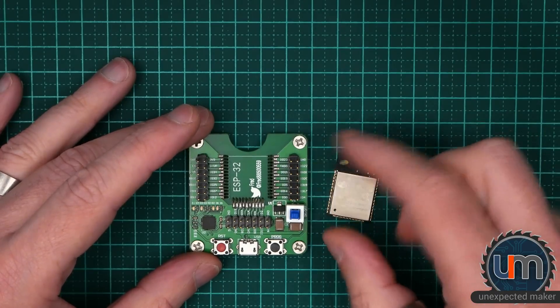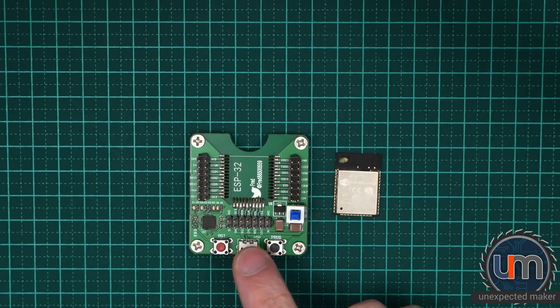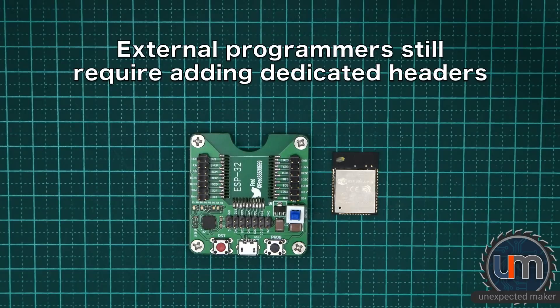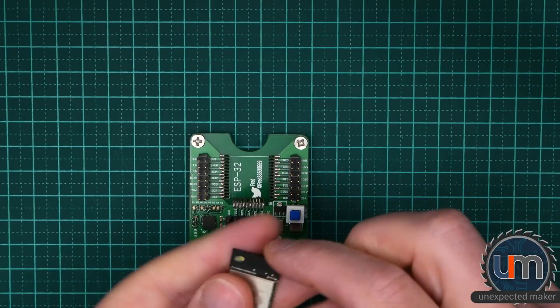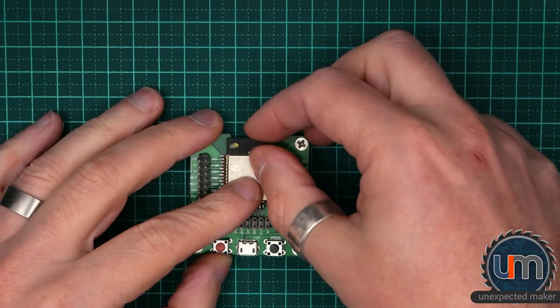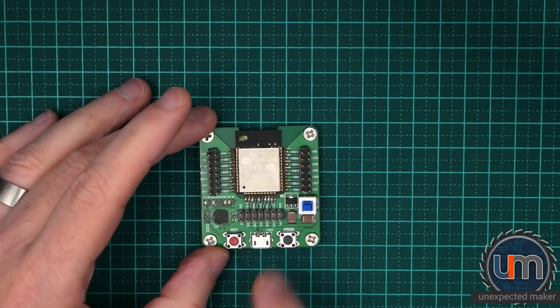So this is a great way for me to be able to check modules. With both Espressif modules — ESP32 and ESP8266 — they require separate USB; there's no USB support directly in the module. You need some type of UART on the board, whereas chips like the Atmel SAMD21s have built-in USB so there's no extra circuitry required. Having to put USB headers and extra expensive components just to be able to program them is a pain. So being able to pre-program ESP modules on something like this and then put them onto a finished product board is a great way to test and get them programmed without extra circuitry.